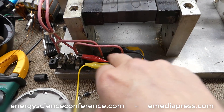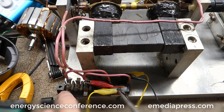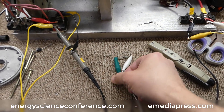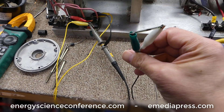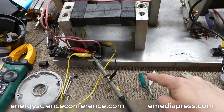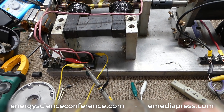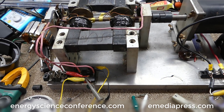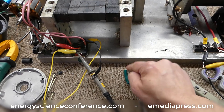What I'm going to do first is get this up to speed and look at what the peak-to-peak voltage is on the AC. Then I'm going to use this reed switch — these are old Lucent Technology reed switches from AT&T, really good for their intended purpose which is not shorting coils. You don't want to short the coils directly with the reed; this is just for a quick easy experiment. You really want to use a reed or reed relay to trigger some other circuit which then shorts the coils — maybe using MOSFETs or SCRs. You can search for shorted coil circuits online and see all kinds of different variations.